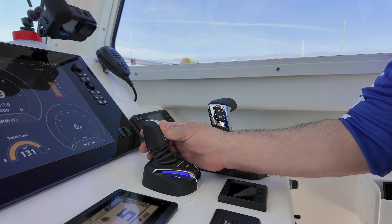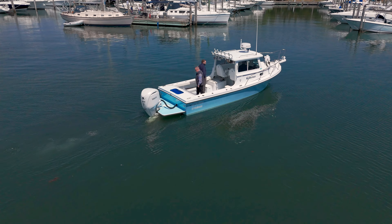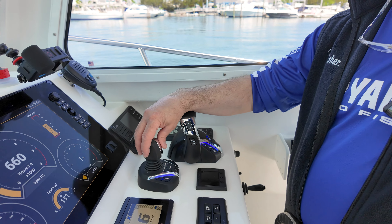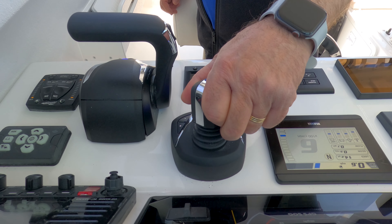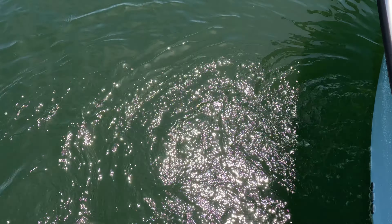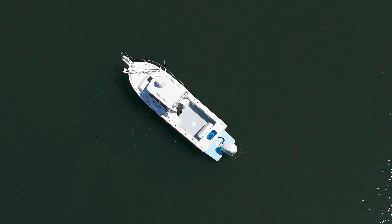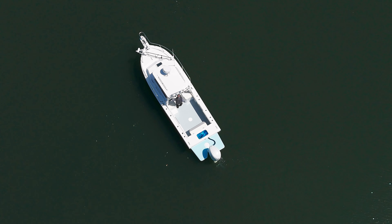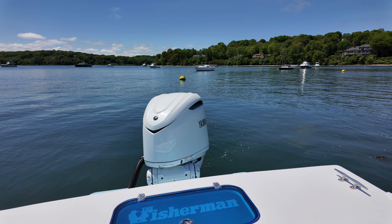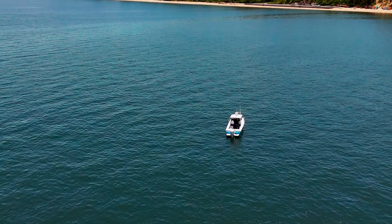And we have forward motion — you can hear that Yamaha beginning to propel as we pull it back. The really cool thing about this is it kind of does a pirouette. It twists, right? So we start to just twist the handle and now the bow thrusters and the outboard are working in concert to keep the boat in a single spot and basically twist the boat. You can see what's happening here — it's very effectively turning the boat, and now the boat is in place just basically twisting. That alone is something you could never do with a single outboard.